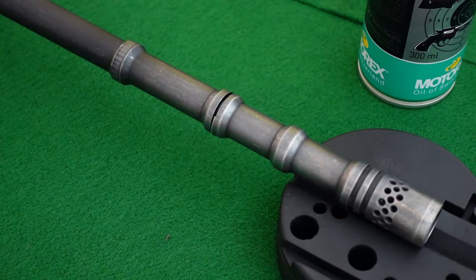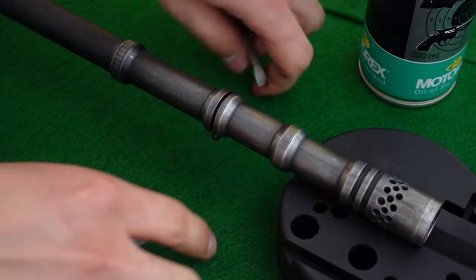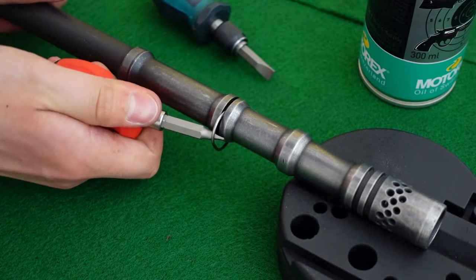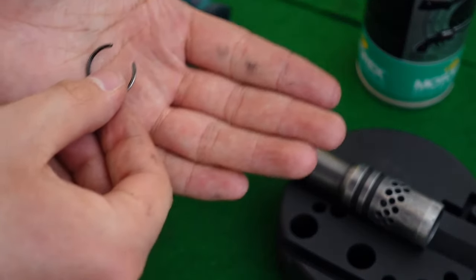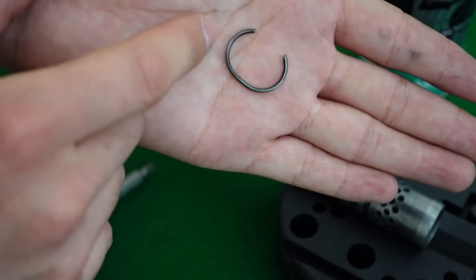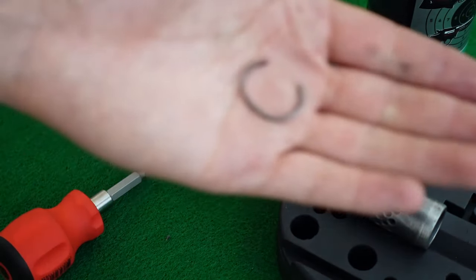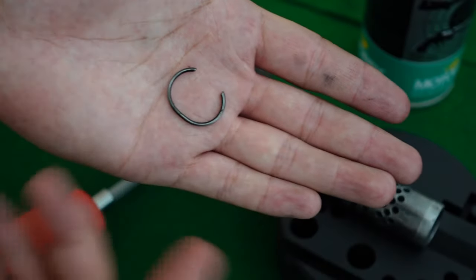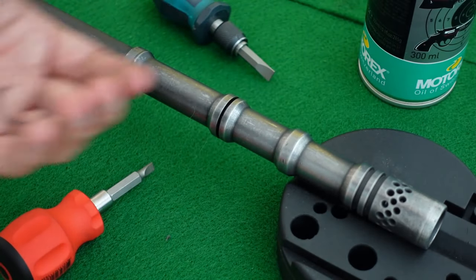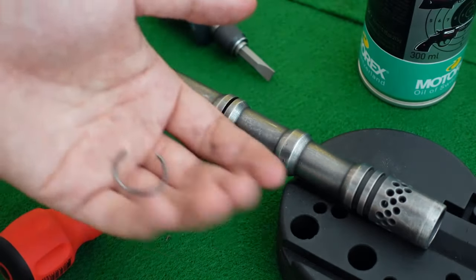It takes two appropriately sized bits and you simply pry the annular spring off the barrel. Once started you can see the spring sticking out, and with the help of the tool out it comes. The rifle grenade annular spring has a horseshoe shape — its largest part is ever so slightly bigger than the internal diameter of the rifle grenade, so when the grenade is slipped onto the spigot the spring deforms slightly, providing static friction for use at negative angles. A pretty well thought out feature. Removal of the spring is not really necessary as these don't fail, but I just wanted to show it.